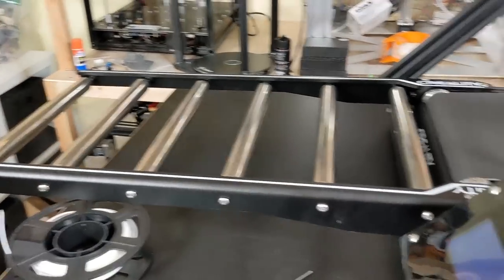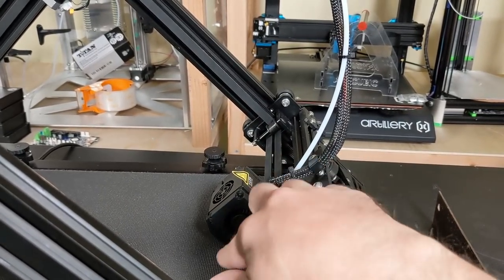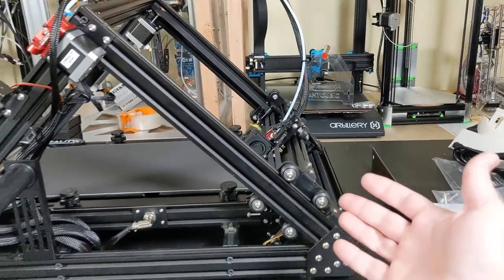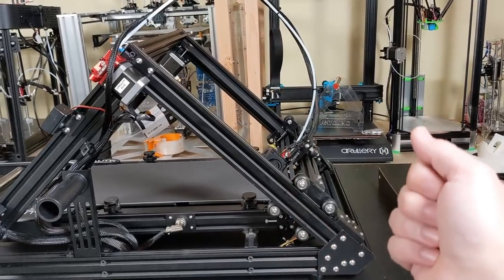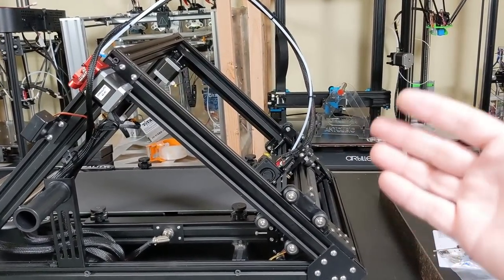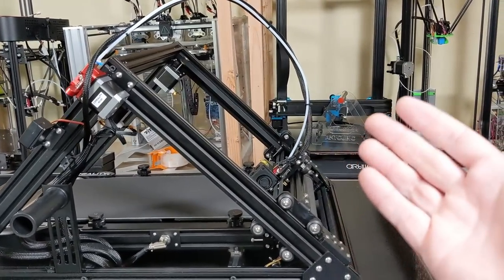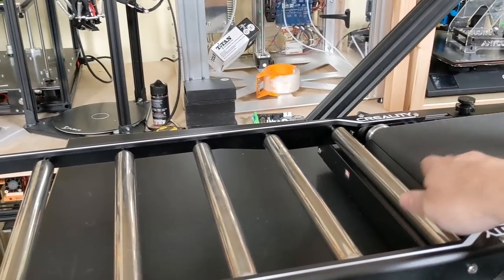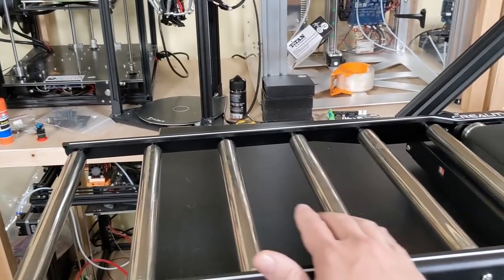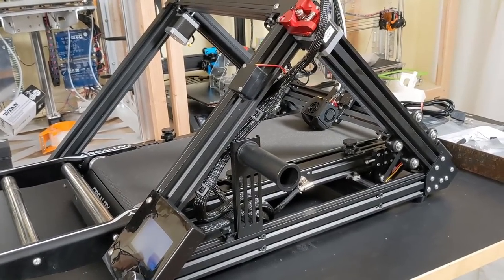So, one, two, three big issues that I've got before I even start to take apart this machine. I still disagree with the part cooling duct too — we'll get more into that later. Apologies to anybody who came up with these designs — I don't know you, I'm just calling it like I see it. Four instead of three wheels is a bad idea. These rollers are too heavy and they don't work — the part isn't even going to touch until way out here, and then only one or two rollers, because they're all misaligned. Three things that just absolutely shouldn't be on this machine.